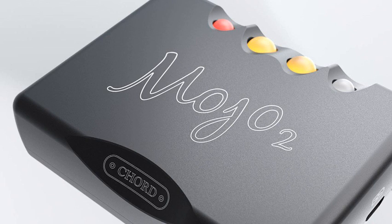I guess we should talk about what you've done with this DSP, Rob. Well, what we wanted to do was remove the coupling capacitor, which meant using a DC servo that I used in Hugo 2. So I've done that on Mojo 2. The downside is that you will lose some of the warmth that was put into Mojo, that slightly soft, warm sound. But getting rid of the capacitor and removing that softness was something I wanted to do because it's going to make it fundamentally more transparent.